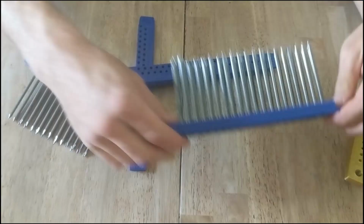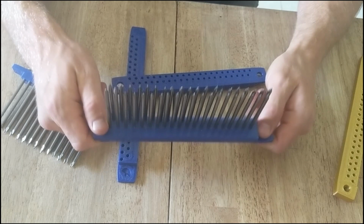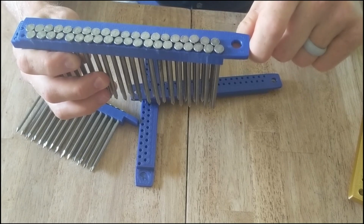The reason why I've designed the nails to be on this side going through is because the print has to have a bottom that rests against the print surface and goes upward. And if I want to have these little ears like so, they would be very difficult to print in this orientation because you would be squirting out liquid plastic into thin air over here. You can fix that by adding supports, but supports are ugly and difficult to remove, so I didn't want to do that. Enter the solution.